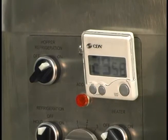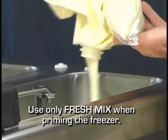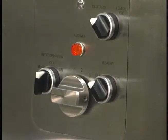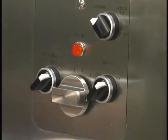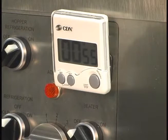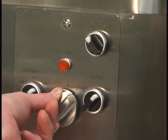After 30 minutes has elapsed, fill the hopper with fresh mix. Install the hopper covers with the raised edge on the back half of the hoppers. Place the beater switch and the refrigeration switch in the on position. Set the timer for one minute. The refrigeration switch will not activate unless the beater switch is on. After the minute has elapsed, open the draw arm plate and turn the flow adjustment knob back to five, then back to two and one half.